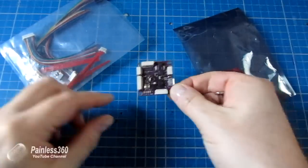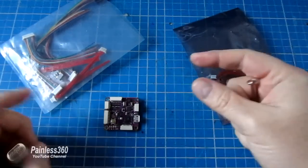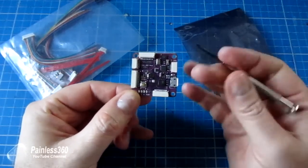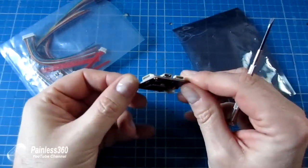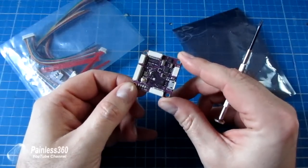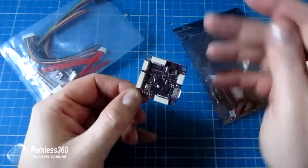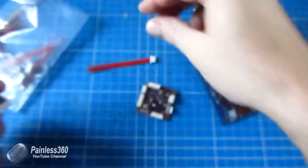It's very small, it's only about 35mm side to side, with 30mm mounting holes. It'll still have to be mounted on an anti-vibration pad, which we'll do in the next video, but the challenge that you've probably already spotted is that because the board is so small, there are no 3-pin connectors like you have on the KK, MultiWii or APM board. It's similar to some of the other smaller form factor boards that are coming out at the moment, where you have to make your own wiring looms up, which is part of the challenge and fun of the APM 3.1.